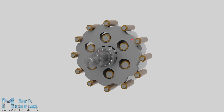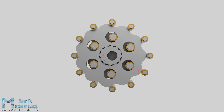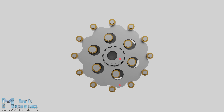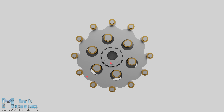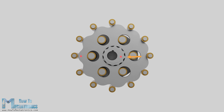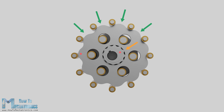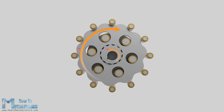If we take a closer look, we can see how the eccentric bearing is actually pushing the cycloidal disc against the ring gear rollers. Because of the unique disc shape and its position relative to the ring gear rollers, as the eccentric bearing progresses, the disc lobes in front of the rotation won't be able to pass or jump to the next ring gear roller, but instead will slip or roll backward. This behavior is what actually causes the reverse rotation of the discs.